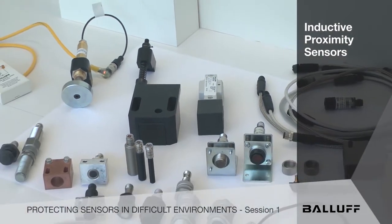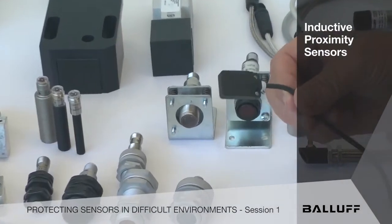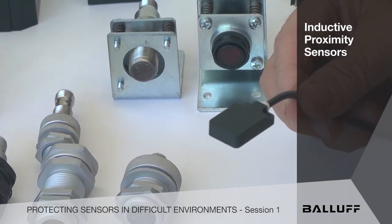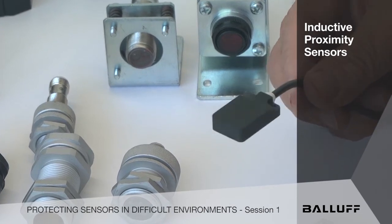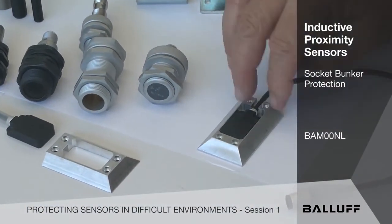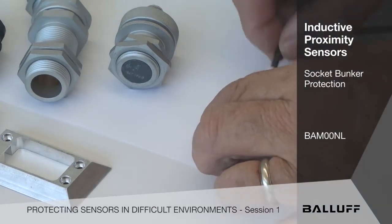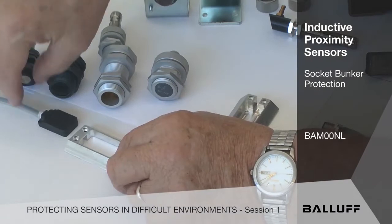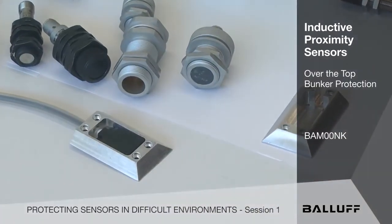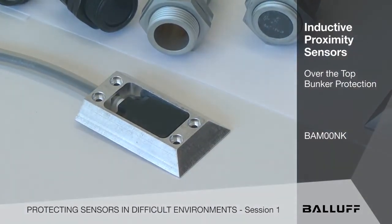There's another enabler out there that we call the RO1Z flat pack. It's a steel face sensor — phenomenal for welding and impact. Silicone cable with a new coating that resists weld spatter accumulation. It has 5mm of sensing range and sees all metals at the same range. But how do we mount these things? Well, they are flush mountable — we can surround it in metal. There's a very nice custom mount that's just a pocket that it drops into. It comes with a kit with screws to both mount the actual mount itself and then mount the sensor to the pocket. And for those circumstances when we have sensors already pre-mounted and flush mounted, we have a slip-over hood so we can guard it — side impact and those types of events, it guards the sensor from being torn off the surface. That's something very unique — we actually have customers that build those themselves.